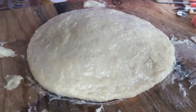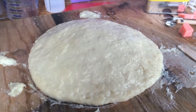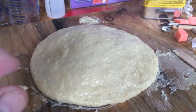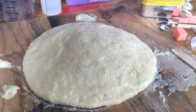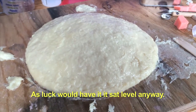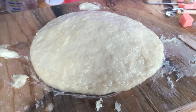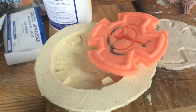Just in case I didn't mention it: the point of a mother mold is that the silicone mold underneath is very flexible, which is great for demolding and holding detail, but you'd get a warped piece if you tried to cure your finished piece inside a flexible mold — so you need the hard jacket. I was toying with the idea of trying to make the top of this a level flat surface by inserting PVC connectors and creating a frame, but I'm just not going to bother. To keep it level I'll set it on a shop towel when I cast pieces.